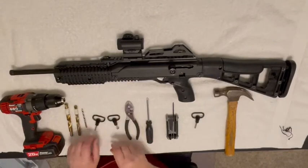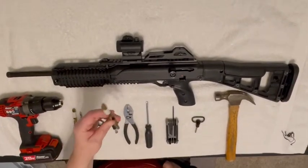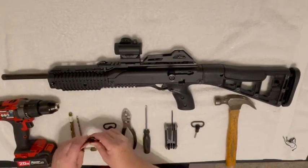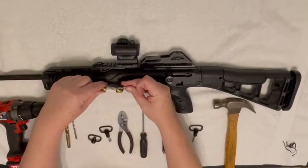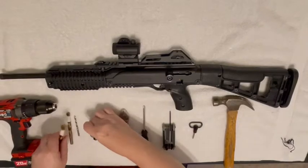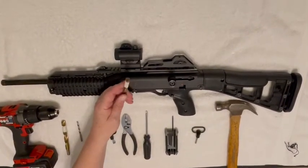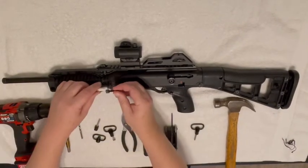What you're going to need is a 13/64 drill bit, and you're going to put tape on it. The tape is going to mark the depth of the cup. Then you'll need a 13/32 bit, and that will be set to the depth of the nut.